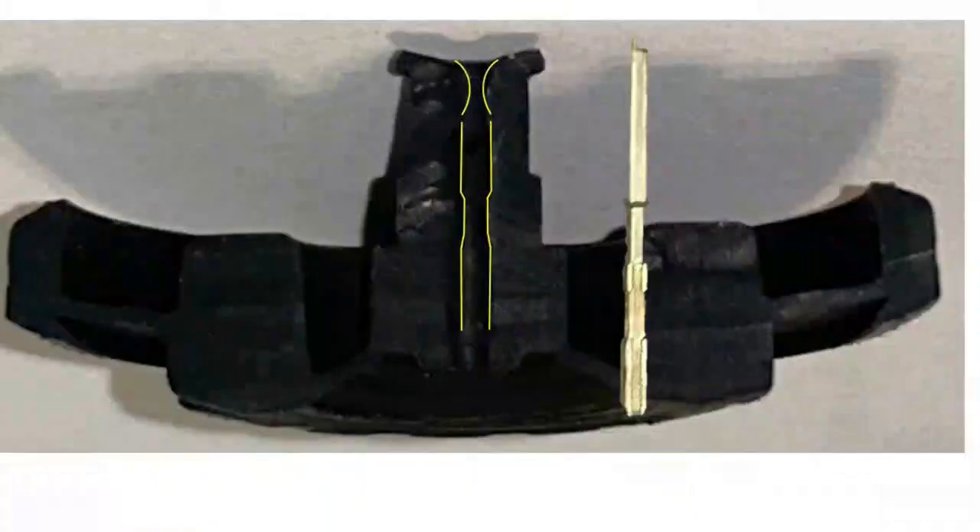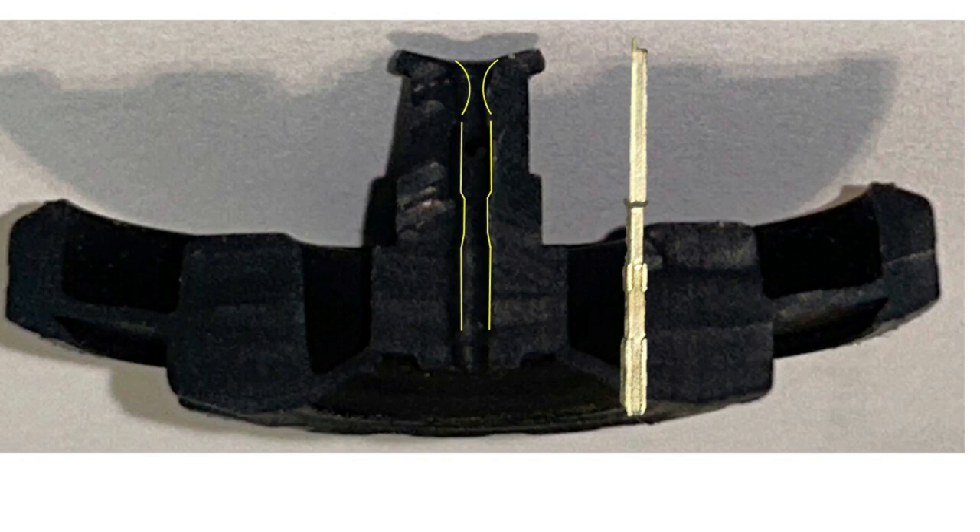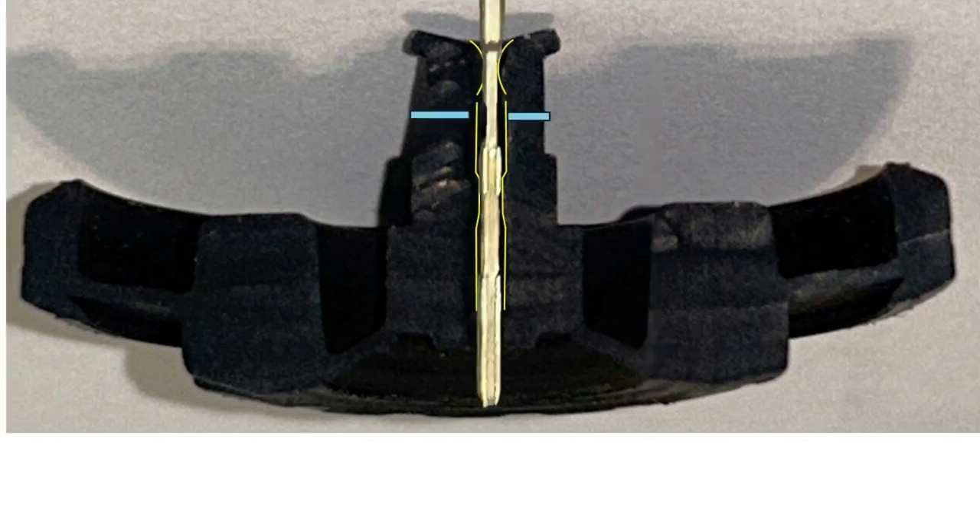Here's another picture of the valve, and I'm showing the valve stem next to it. Now let's insert the valve stem into the seal. As that valve stem goes up and down, there will be certain areas that are sealed against water flow and other areas where water is able to flow — that's how this seal and valve stem operate together.